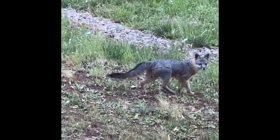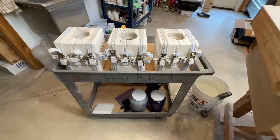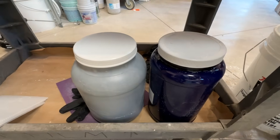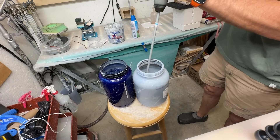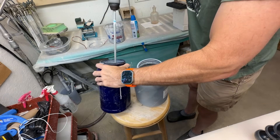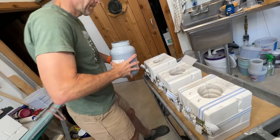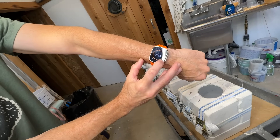Okay, good morning. It is 6:30. I just saw a fox — that is the best way ever to start the day. Let's pour some porcelain pounders, shall we? The porcelain pounder molds live on this little cart, which makes it easy to get it out of the way when we're not casting. We have all three molds, and on the bottom I'm keeping a couple gallons of the black porcelain slip. We kick things off by agitating the slip, just like the normal stoneware slip. This will gel when it sits overnight, so I mix it up to get everything fluid and ready to pour. We carefully pour the liquid porcelain into all three molds and let it dwell for exactly 22 minutes.